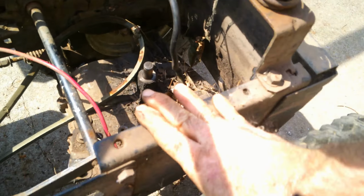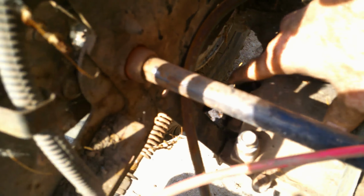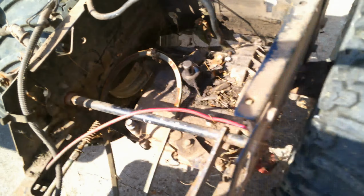And the whole back of this tractor, on this model, I don't know. Bolts on, looks like. But here's how your shifter works. That's probably 7. That should be reverse. Up one should be neutral. You see it spinning there, this right here. Neutral, you go up one. So you could actually just take this and make it straight, but that's the way they designed it for safety.